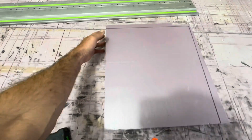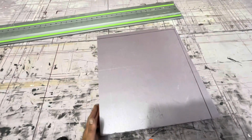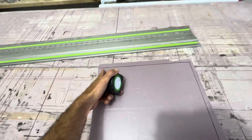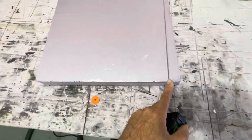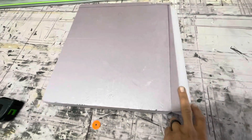I went ahead and already started. I first started by cutting the first square cut, which is just the length, making sure it's square and 17 inches long. Then I started by measuring — I was 16 wide and I had to go to 15 for my first cut, so I measured a half inch. You can see my mark in there. And then on the bottom I cut a quarter inch off each side — you can see my mark an inch and a quarter from the edge there. That'll give me that tapered shape for the cooler interior.